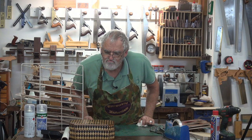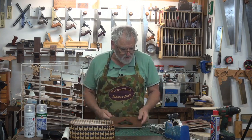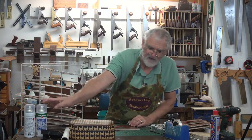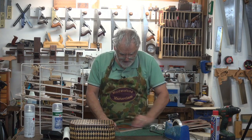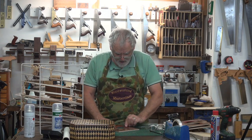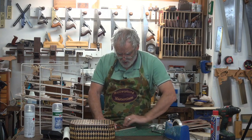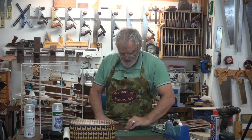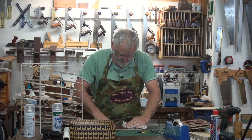Yeah, look, it depends, Andy. What do you want? Do you want it to just sit there? Is it one that's going to be used? I quite like oil finishes. As I said, the quickest finish, if you really want acrylic, it gives a nice finish. Oil finishes are nice and soft, but you can get finger marks on them. French polishing is my preferred finish, but it takes a lot of time, and if it's not a labour of love and you're not getting paid for it, don't do it because it takes so long. If it was going in an exhibition and it was a good exhibition, I'd French polish it. But I would stay away from wipe on poly, I tell you. What rubbish. Yuck.